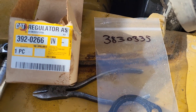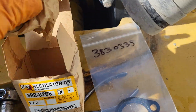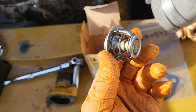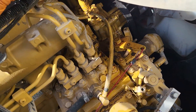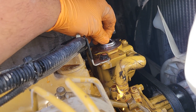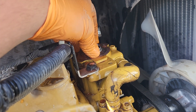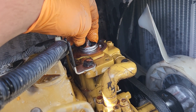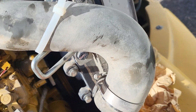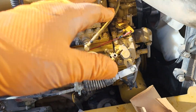It might vary slightly, but I think it's going to be pretty much the same thermostat. There's your gasket. I always like double-checking and making sure it's the exact same one. Go ahead and put that back into its hole — there's no slot or anything. Just make sure it's down in the groove; pop it down into that recessed hole.